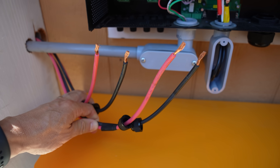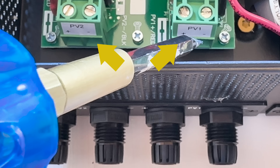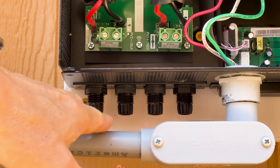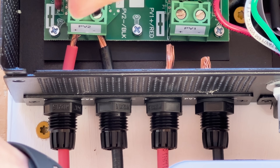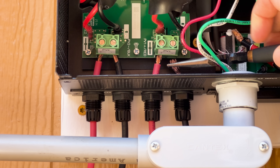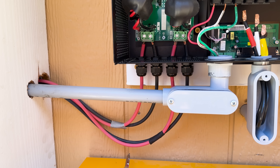Four wires are coming from the solar panels into our shed. We're now going to connect these to our inverter. As you can see, we have four places to connect these on the inverter. Let's connect our first strand of wires. We're going to use our flathead screwdriver and open our insertion point by turning counterclockwise. If you look underneath here, you can see the positive and negative terminals. Open both the positive and negative terminals for all four wires by turning counterclockwise. This opens the terminals to allow us to insert our wires. Next, we're going to feed all of our four lines into the glands at the bottom of the inverter. We'll connect the first set of wires into our inverter starting with the red wire, which is the positive wire, into the terminal with the plus sign and then tighten it down. Next, we're going to insert our negative wire into the terminal with a negative sign and also tighten it down. We'll repeat the same thing with the following two wires, carefully inserting the red cable into the positive and the black cable into the negative. Sometimes when feeding lines in, the wires may become a little bit frayed — having a pair of pliers will enable you to fix that problem. Finally, we'll tighten those nuts on the glands to secure the wires.